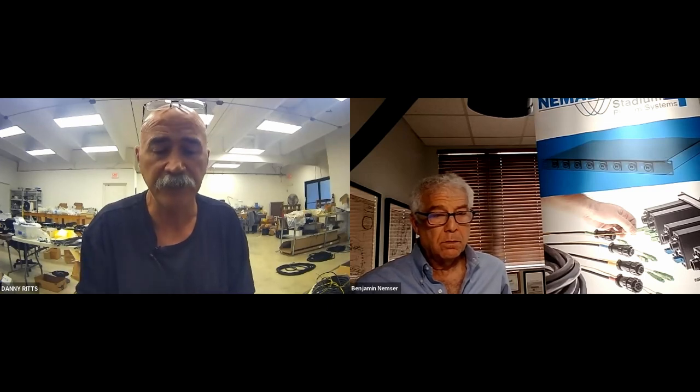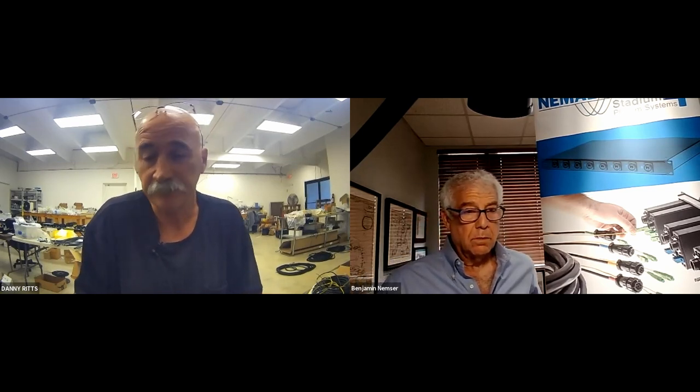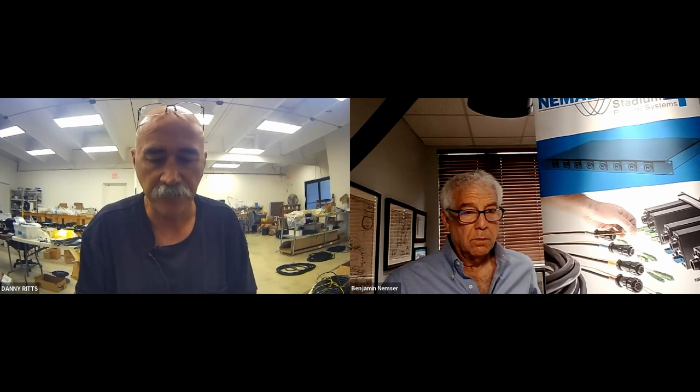And the benefit, in the broadcast world, is that we're actually getting more and more budget for light loss than we had before. In the beginning, I'd plug 6 to 8 cables together, and I was reaching maximum usage of a camera back to a CCU. Now I can plug 20 of them together and it doesn't make a difference. So to answer your question, I'm not splitting hairs on a little clean or a lot clean and getting digital dropout. Not my personal experience. No.